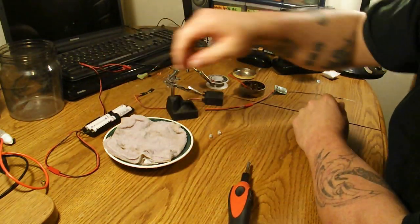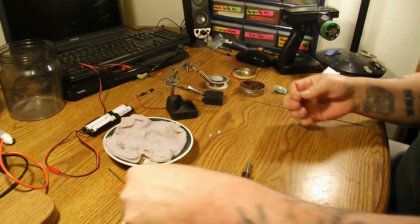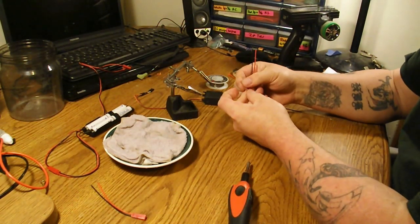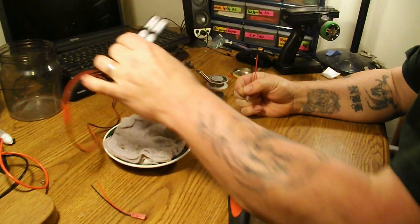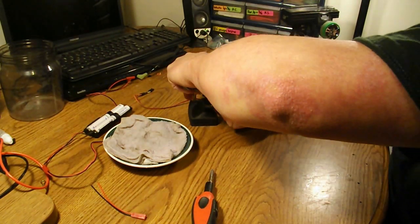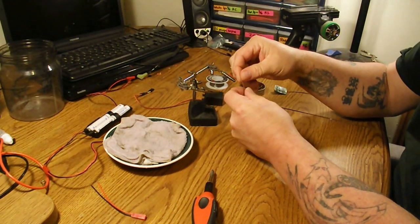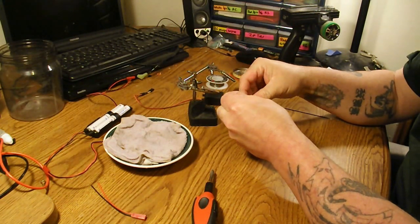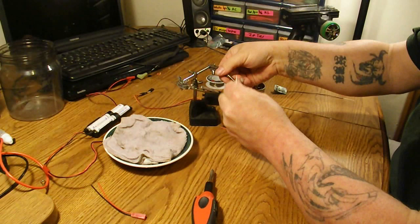The first thing I want to do is make my LED harness. I'm just using two white 3.3 volt LEDs because I'm going to be using this battery pack, and I don't want to screw around with resistors or anything for this because this is just a test. So I'm just going to wire these in series, long leg to short leg, and then wire these wires onto them.